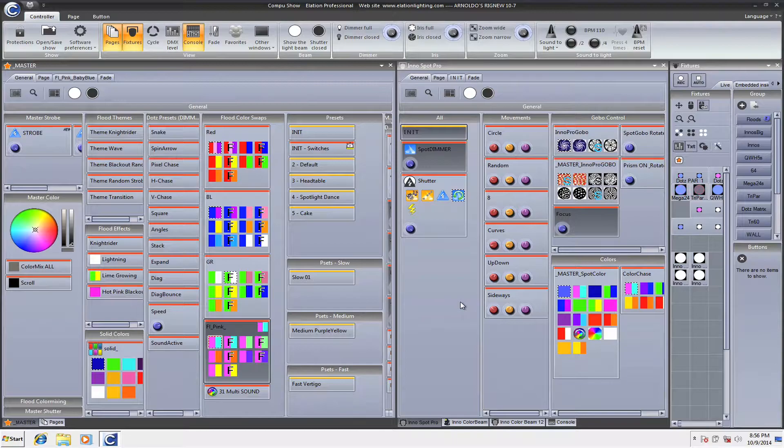With this particular light, even though I can't do UV as a black light while the floods are on because the color mixes, it still allows me to do those effects separately. But I wanted to find a way to easily program this, because when I looked at the instruction manual I saw there was only one dimmer and only one shutter. That means if I make it strobe, everything's going to strobe — which may not be what I want. So how can I make this work?